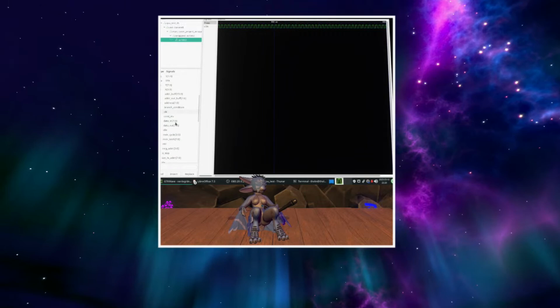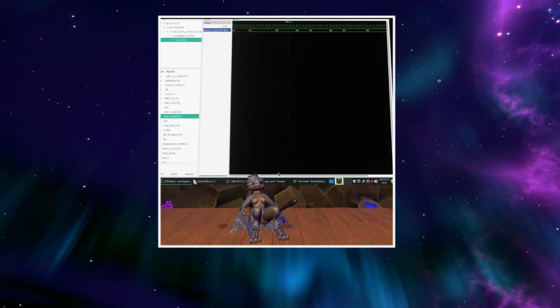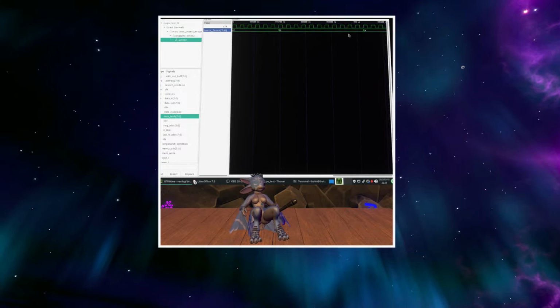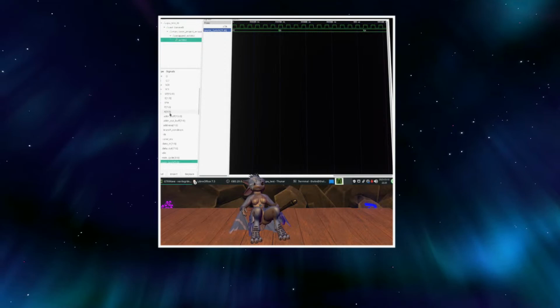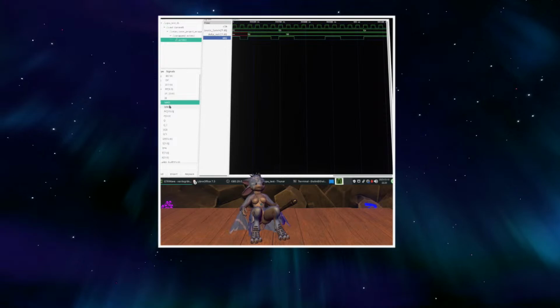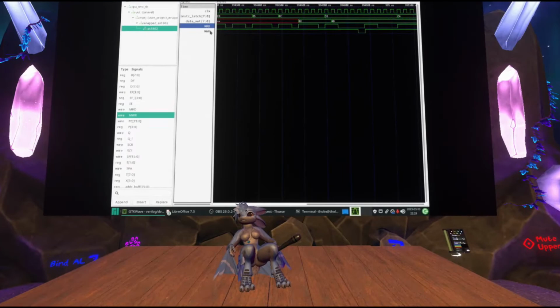So there's this register inside the processor called instruction latch, and it literally just contains whatever instruction the processor is executing right now. So you can see the actual instruction sequence being executed changes every few clock cycles as it fetches the next instruction. I can look at the memory bus as well, and at what it's presenting on the output pins. I can look at whether it's currently reading or writing. These are both active low, by the way. This is read enable and write enable. Read enable goes active all the time because that's to fetch instructions, and write enable only goes low once, during the final store instruction, when the final test is run.